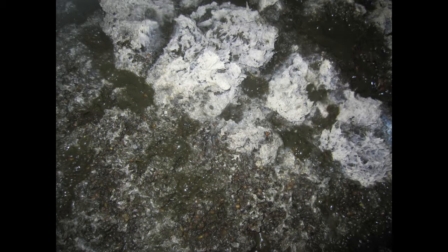These bacteria make a white film on the surface of the digester. All the sequences here have been speeded up, as the whole point of this type of mixing is to minimally mix in order to let the material stratify into digested and undigested layers, so the colonies of bacteria can work on the undigested material and the highly digested liquid layer can be pulled out. Thus there is no need for plug flow or high energy use excessive mixing.